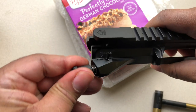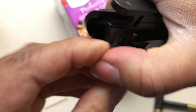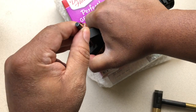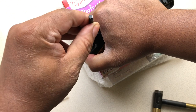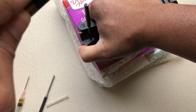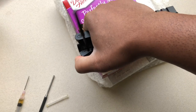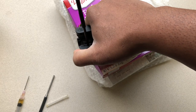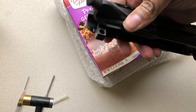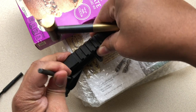I'm just gonna get this in place. Now it's under spring tension, so I'm gonna hold it just like that and get my roll pin starter punch. As you can see, we already have it all captured — just gonna transition to the harder punch now to finish this off.